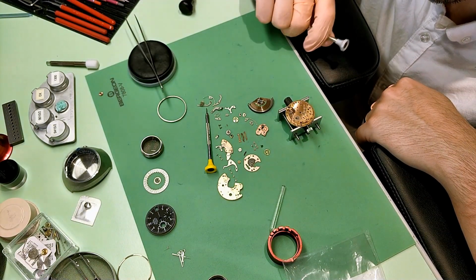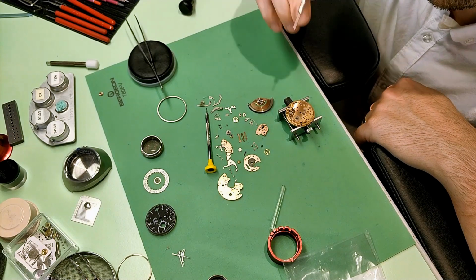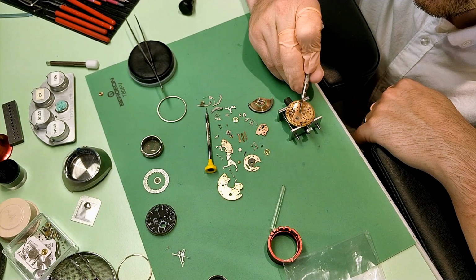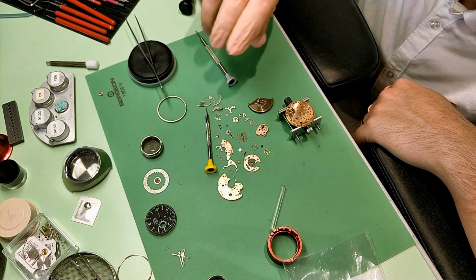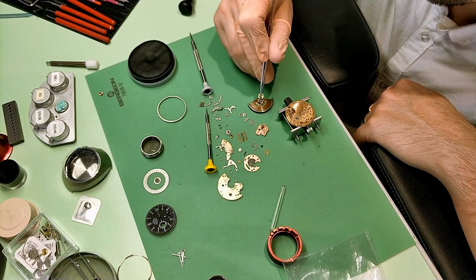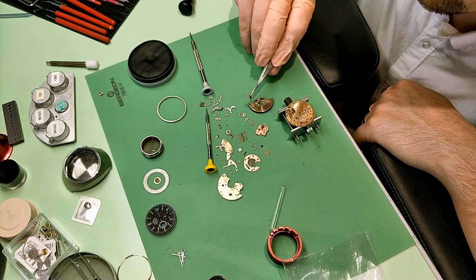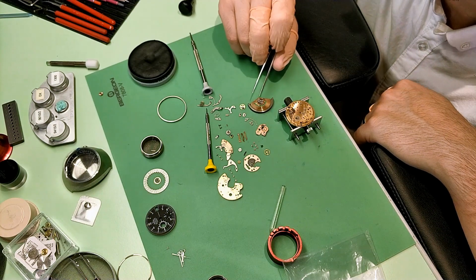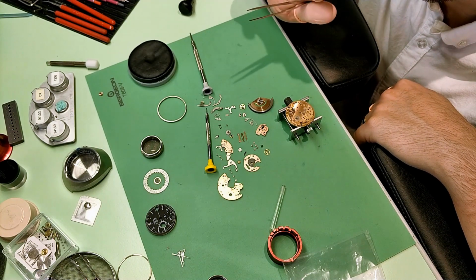One question: what's that small green piece in the middle? Because I understand it's kind of an anti-friction coating, I think. But what does that piece do? Basically that's the spring, and it sits on the back of the chrono runner, right there, where it's mirror polished. It's basically to just prevent the shake of the watch.